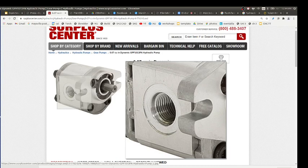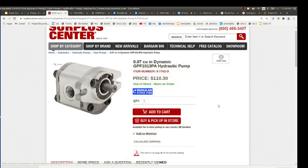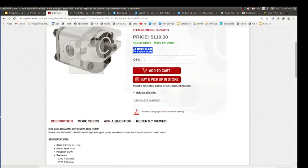Like the 1-inch hoses, they have to be much thicker because they have all that surface area. But mostly it's for the suction. The suction line is going to be big because you don't want it to collapse on you. It has to be reinforced, because if it was a small diameter, you'd be sucking on it so much that it tends to collapse. So it has to be wire reinforced and larger so it doesn't collapse and has good suction. Anyway, the big part is suction, always, on these pumps.